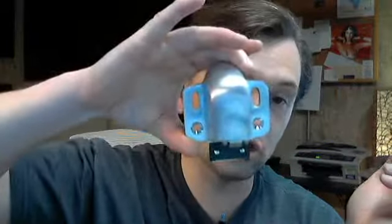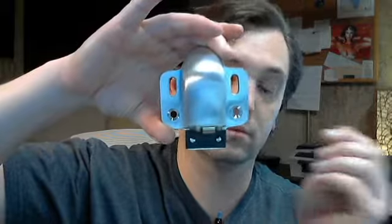The attachment of the housing to the door is such that you would install screws in the two slotted holes first, after having attached the floor strike to the floor. Utilizing these two slotted holes first before you drill the others will allow you the ability to vertically adjust the housing on the door. Once you know that the placement on the door works best with where the floor strike has been installed, you would then go ahead and drill these two additional screw holes.